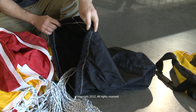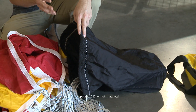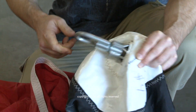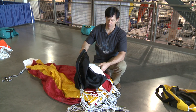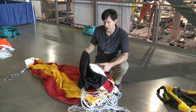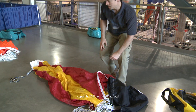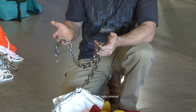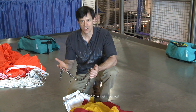In an effort to make deployment easier, this company, like pretty much all the others in the industry, has designed a deployment bag — the parachute sits inside the bag and you drop it in the water so it can self-deploy. The issue I found with this model is that since the hardware and rope are attached on this end, it has a tendency to spin the bag up, keeping the chute from deploying. The bag will float for long periods of time, and the one thing that works really well is the addition of 20 feet of chain — I want to get it sunk underwater as quickly as possible. They did add a chain here as a sinker weight, but it's just not enough weight for deploying the chute. Their concept is to help keep the parachute canopy from oscillating so much so it doesn't pulsate like a jellyfish and turn inside out.